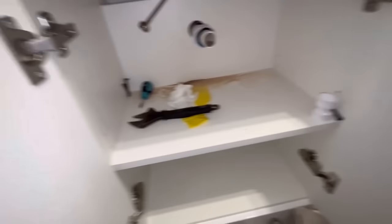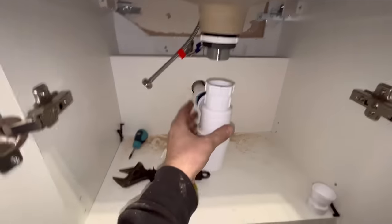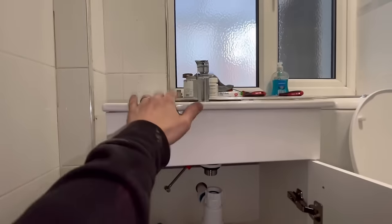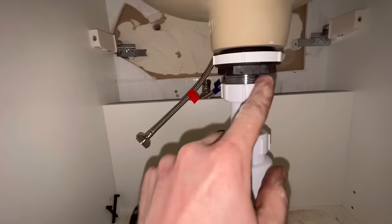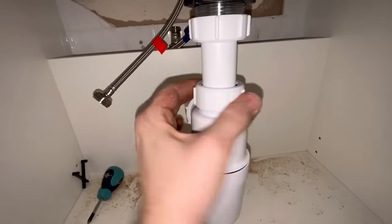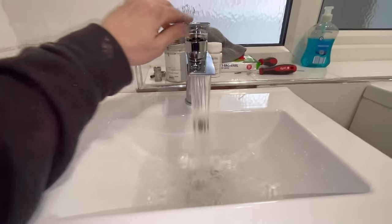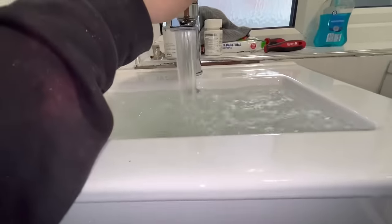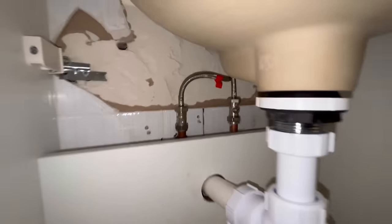Thomas Dudley basin mate — absolutely love them. Let's get the taps on. I've fed the basin up, got it onto the sink, and the waste is near enough spot on. That should line up nicely once it's on properly, and the hot and cold should line up too. Some people say with the basin mates you can't get the compression right — look, red-line compression on that one. Tighten that into the length you want. Let's get the hot and cold on, fill it up, and test the overflow first.